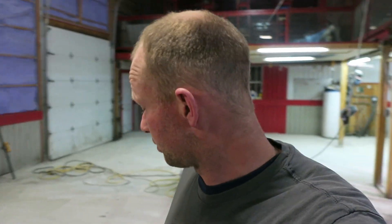One thing I do want to mention: you cannot pour a floor without it cracking. The point of a cut — when you take your saw and make a groove in the concrete afterwards — is that the crack will follow the groove. I didn't cut my floor, so you can see the crack here. That's nothing to worry about. I have cut customers' floors when I poured floors for them, and it's basically just preference. My creeper doesn't hit a bump in the crack in the floor, although it does hit a little bump when you cut it.